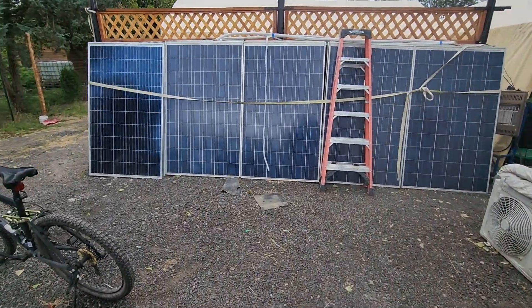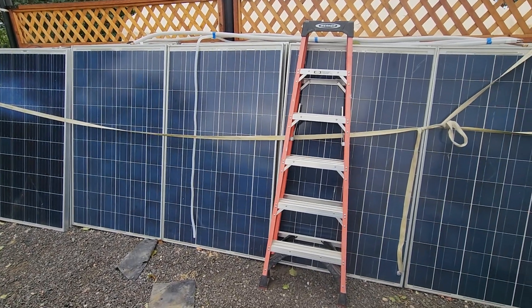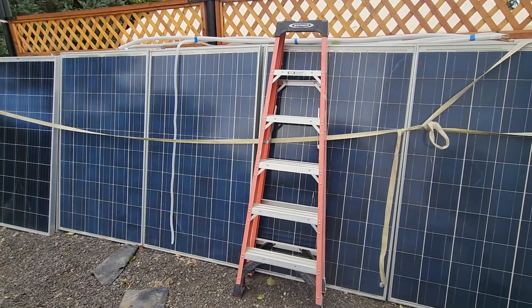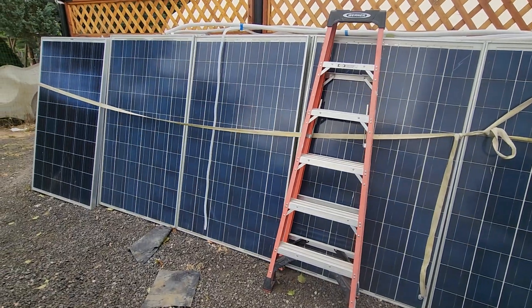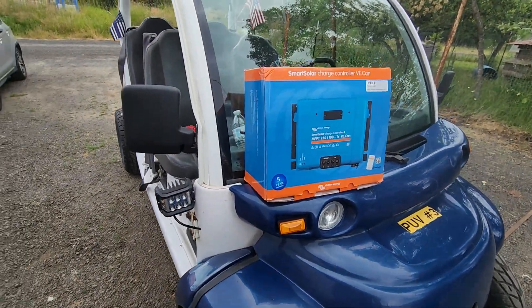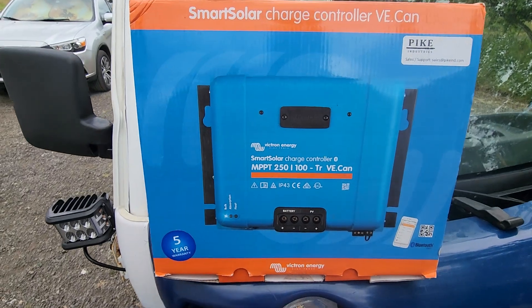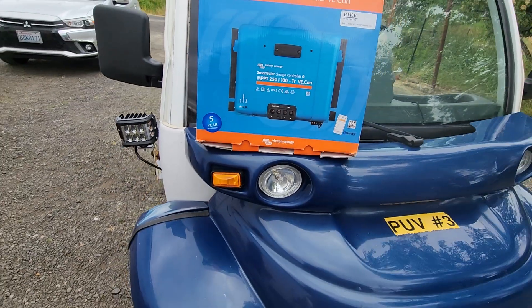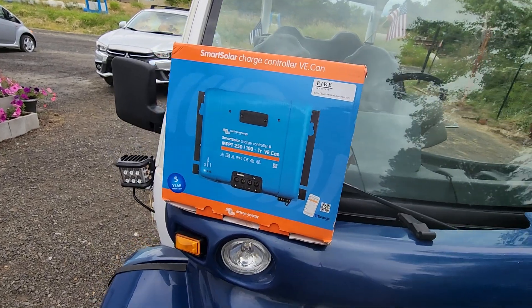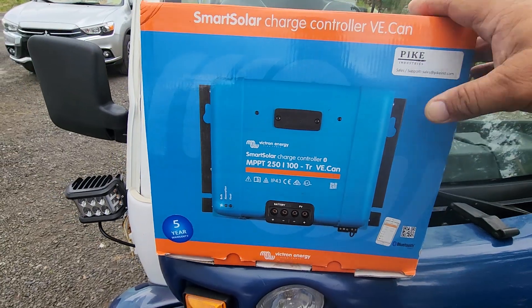Ultimately, my plan is to create a solar carport-gazebo type setup and charge it at 80 amps with solar, DC to DC direct. Part of my issue is finding a solar controller that will handle a 72-volt battery — there aren't many. It looks like I could order something off Alibaba or AliExpress. The Victron is an amazing piece of equipment, but it only goes up to 48-volt batteries.